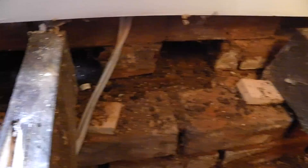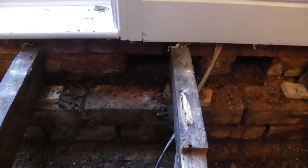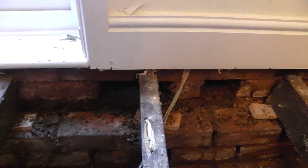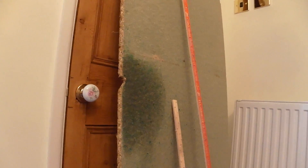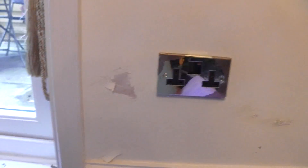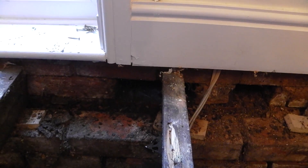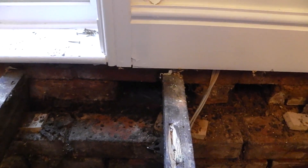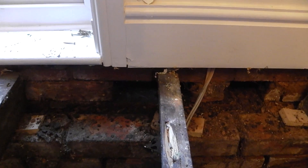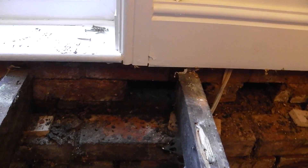Just to give you an indication of how bad the problem is - this is covered with a piece of moisture-resistant chipboard, the green variety. I'll show you the underside, which coincides with this area here. That was where the moisture was trying to evaporate, and it was actually eating away at the bottom of a board specifically designed not to be eaten away.